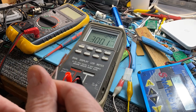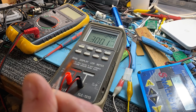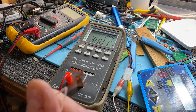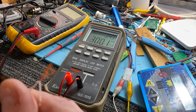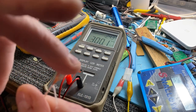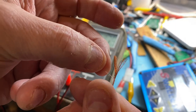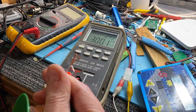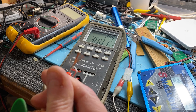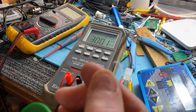So you've got to use very very thin stranded wire - this here is Litz wire, usually wound in cotton or polyamide these days. If you pull off the insulation and fluff it out, you can see there are lots and lots of very fine strands. Each one of those strands is not pure copper - each one is lacquered so all the strands do not touch each other; they're all insulated. That's how you get rid of or stop the cross-sectional eddy currents from forming. There's nothing in the frequency spectrum of where these detectors operate that can generate an eddy current around something thinner than a human hair.